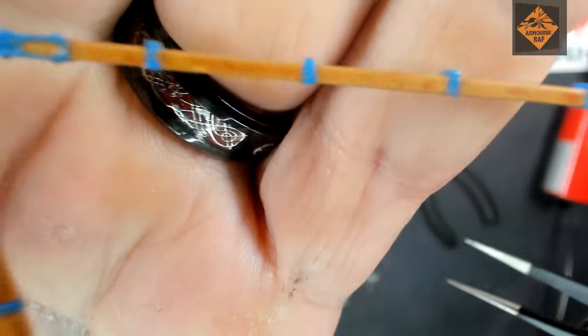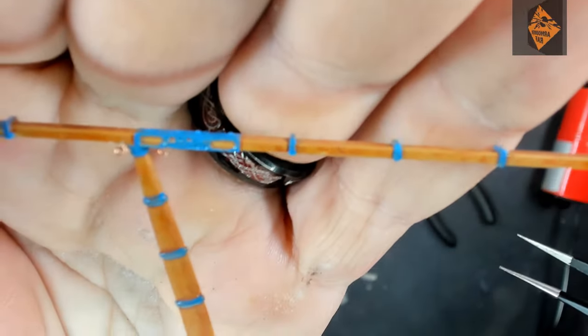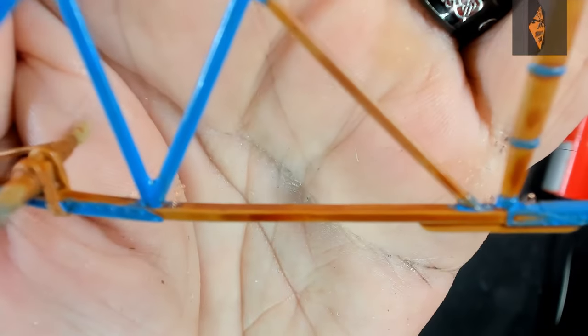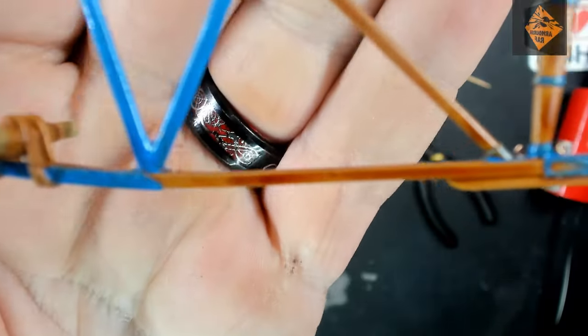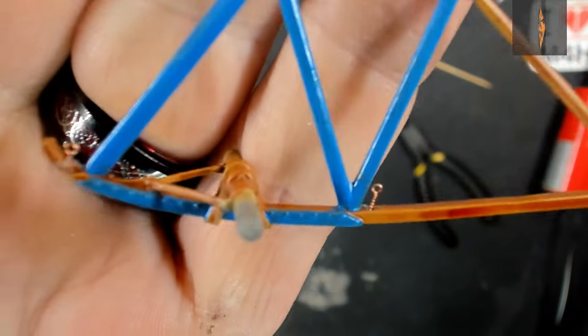That's the eyelets for that tail strut done. We also had to redrill the holes out to 0.4mm, then later on we did it again to 0.45mm. We then did the other one, which had no issues at all, so I'm not going to bore you with that one.